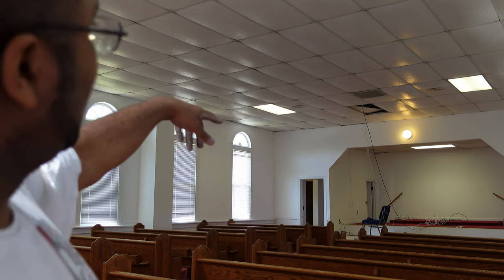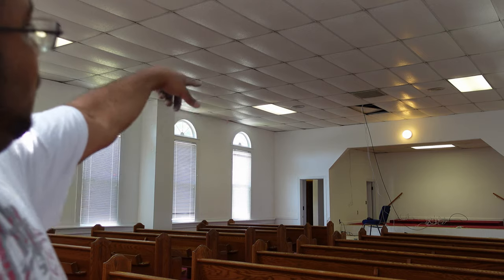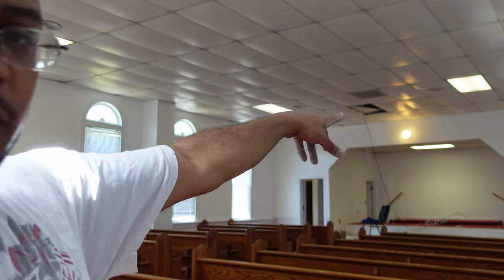I'm probably going to pull another ethernet cable — I don't need to push it all the way back. I'm going to put it maybe two tiles up from this air conditioning vent, and that's where I'm going to put the access point. I'm just going to run it enough to have some leftover cable and fish it over to the side of the wall and through the hallway. I don't know where the router is or if it's even wired for internet in here, so I'll leave maybe 50 feet extra in the ceiling so I don't need a coupler to extend it.